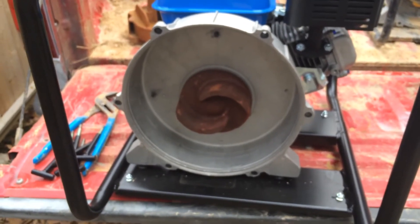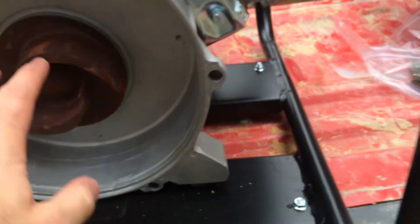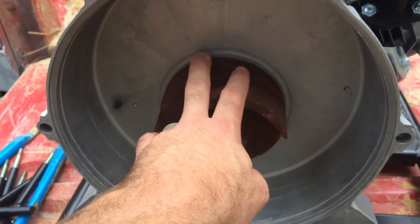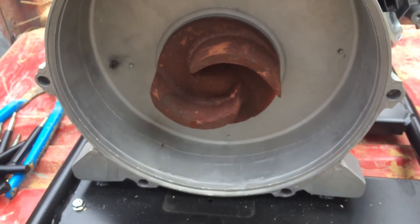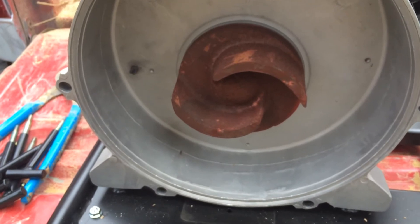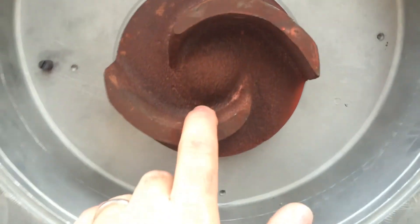Because those last two were leaking straight out of the box, I wanted to check this one before even starting it. The reason they were leaking was that the four bolts behind here — the ones that hold the pump body to the motor — were not tight. On one of the other videos, two of them actually worked their way out and locked up the pump.